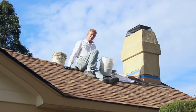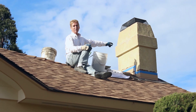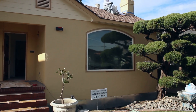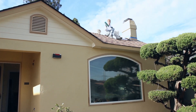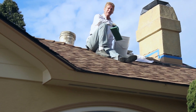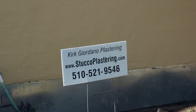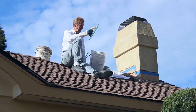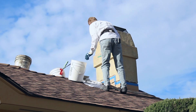Kirk and Jay here with Kirk Giordano Plastering. Today I'll show you how to do this chimney — it has a skip trowel finish. The house has a brand new float finish, a two-coat system using a sponge float to give it a sand finish. That's a better word for homeowners, because people ask what a float finish is. You float it and bring out the aggregate — it's a sand finish around the house done by real experts.